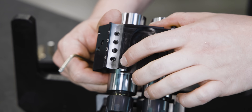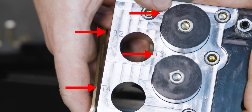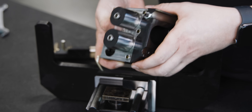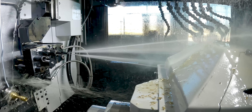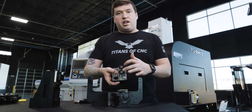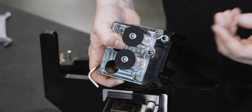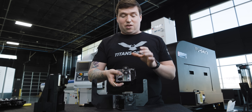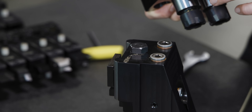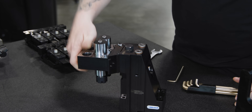You'll see there are two rails labeled one through four, and the stations are also labeled one through four — that correlates with the set screws. When you take the set screw out for station one, station one is going to have coolant flowing through that slot. It's all drilled, tapped, and plugged through the holder. But if you don't want to use this sleeve and want to use something else, they've also given you plugged holes where you can put a standard fitting to have coolant come right out of your tool. You can do whatever you want — you don't have to use this system, but it's there. So depending on what station you want coolant to, you just take that set screw out, throw this on, and you now have coolant through to your holder.